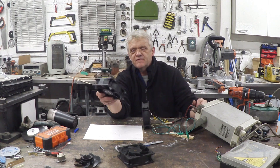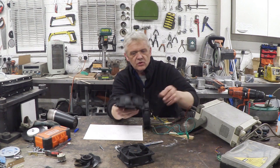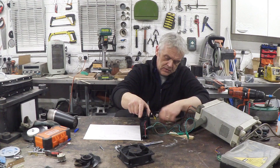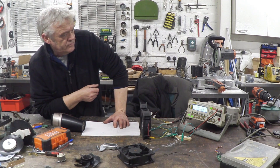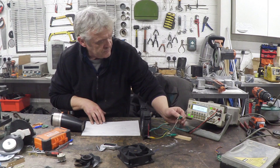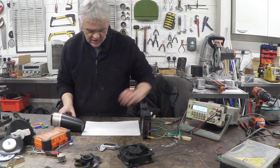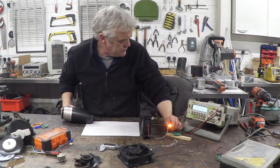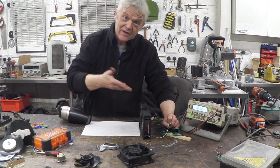What I've got here is an identical PC fan where the only modification I've done is to make it into a generator — I just removed the circuit board and soldered the wires onto the ends of the coils. With that one, I've got a voltmeter and a little LED as a load. We can get about 1.4 volts out of that and we can't light our LED. Now let's try our modified one — we get 2.6 volts out of that easily, and the LED lights brightly.